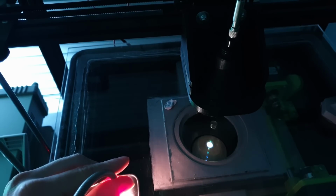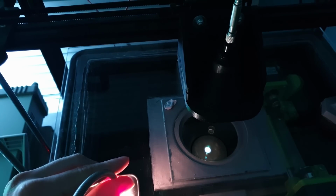And when the fiber was weakly coupled with the light, this happened to be the case. But unfortunately, when the fiber was strongly coupled with the LED, you can see that a lot of light wasn't able to be focused into the focal spot. Now, I suspect the reason for this is that with the fiber 2 focal lengths away from the aspheric lens, the effective aperture of the lens isn't large enough to focus all of the light.